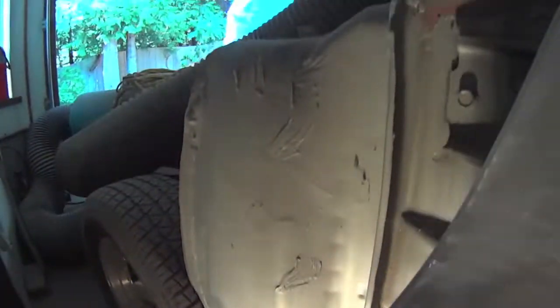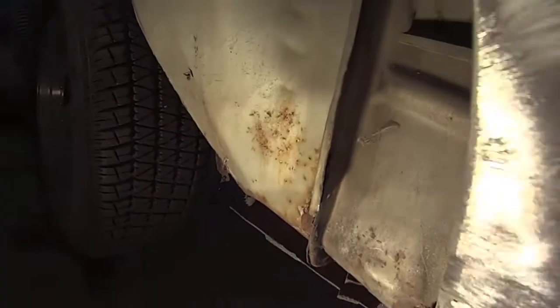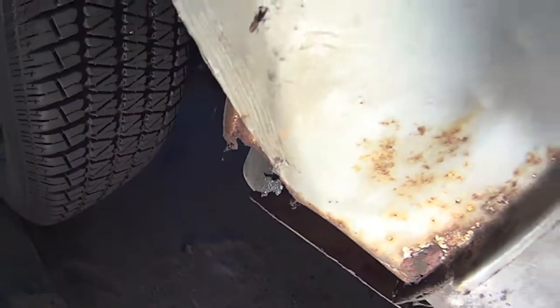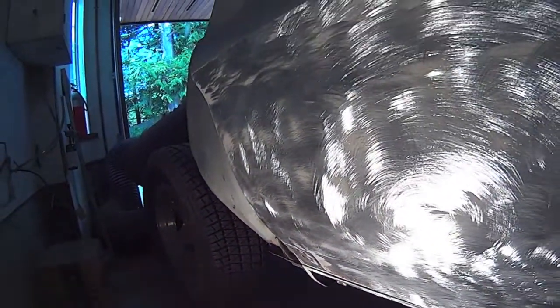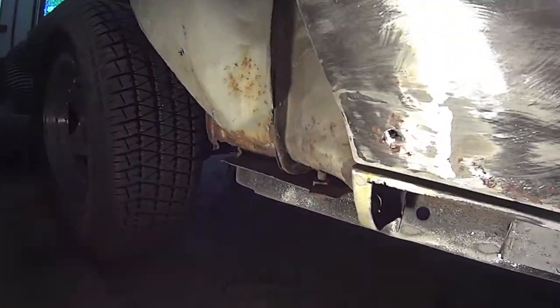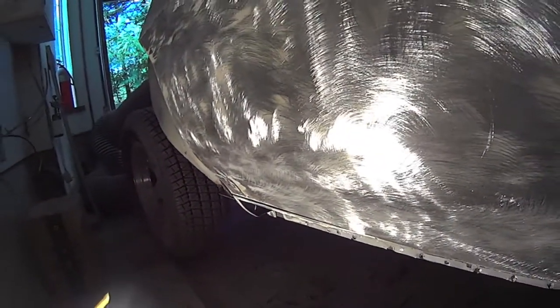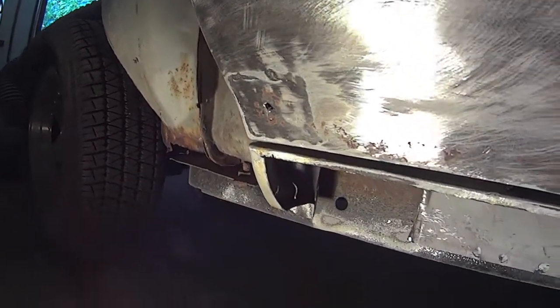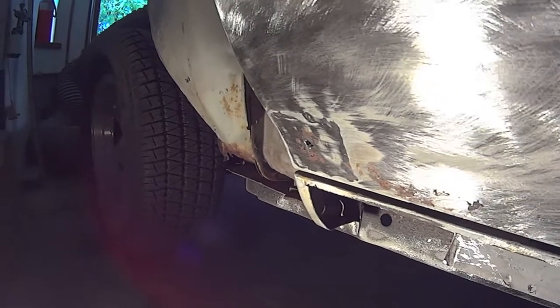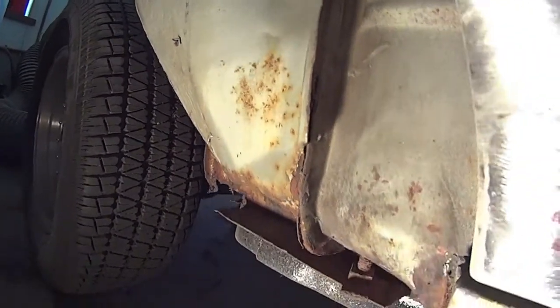This looks like it's in reasonable condition. The cowl. I'll sandblast the outside, it's rotted here. Not bad, just one little piece. Snap bolt there for the fender. Just pour some oil down the cowl after it's all done. Get that waxy oil stuff in the spray can. It's got anti-corrosive additives, which will help out. We could even drill a couple of holes there, just for access, put some rubber plugs over them and put the spray nozzle in there and spray it around.